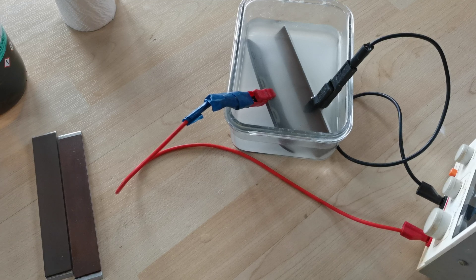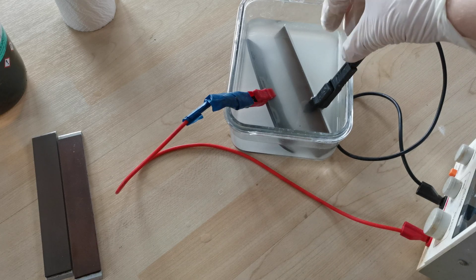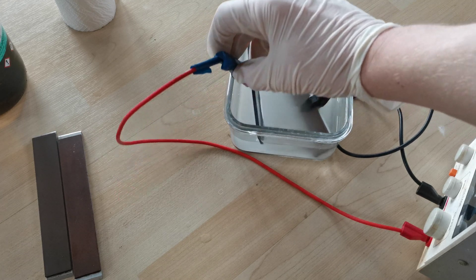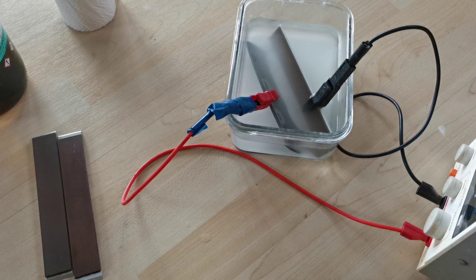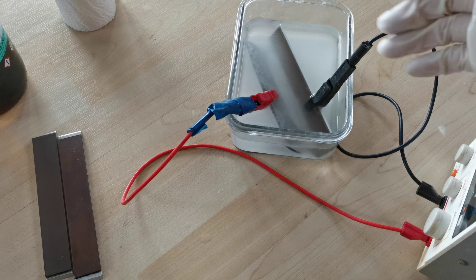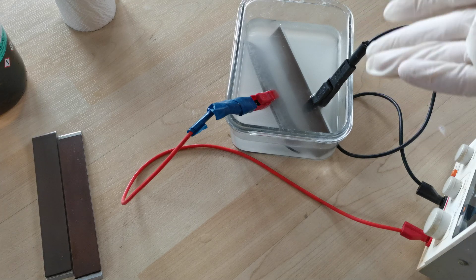This is reverse electrolysis as I've mentioned. The black clamp — the negative — is the cathode. You put that on the stone you want to clean, and the positive red one — the anode — you put on a random metal piece. Then you put both pieces inside your container with the baking soda water. Make sure they don't touch each other. All you have to do at this point is hit start. I use 30 volts and 1 amp, and you can see some bubbles forming immediately on both parts. What's happening is copper ions are traveling to your anode, and your stones are self-dressing.